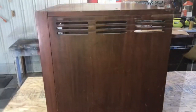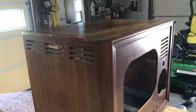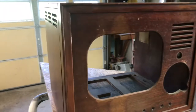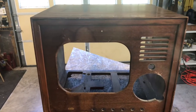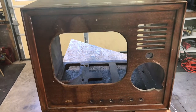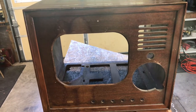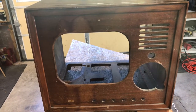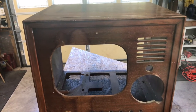Time to start stripping this finish off. I think this originally was what's called a red mahogany — that's what I plan on putting back on as far as the stain color. I'm going to try a technique I used on a couple of radios I've restored: take acetone and strip off that outer finish, then sand it, restain it, refinish it. If it turns out like the radios I've done, it should look fine.